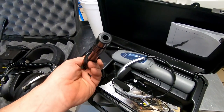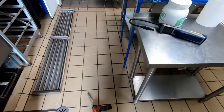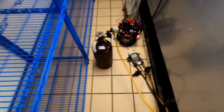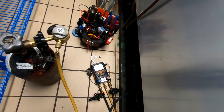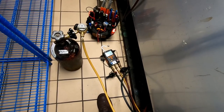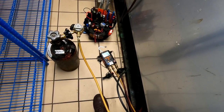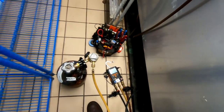This one does have a nozzle for when you've got a lot of noise and need to narrow it down. We scanned it with the electronic detector and nothing went off - it only had three pounds of pressure originally. I reset the timer to see what kind of drop we've got - we're at 0.1 so far and it hasn't even been a minute. I've seen tight systems lose a pound over ten minutes, so I'll watch it. The sensors in these things never seem to hold very accurately.